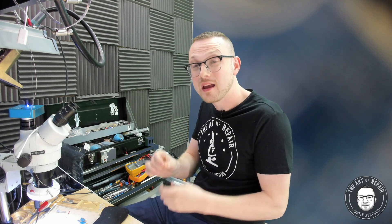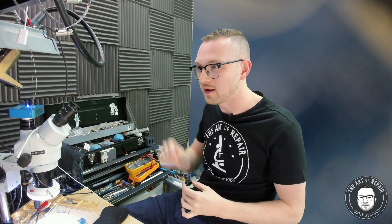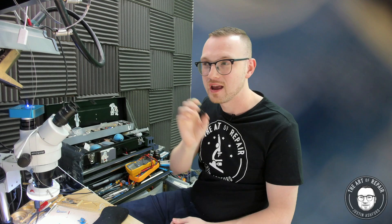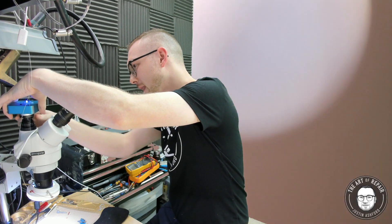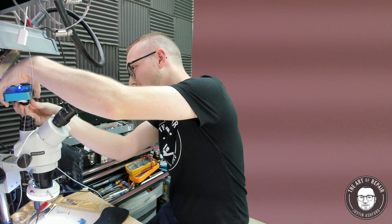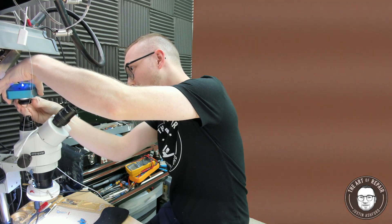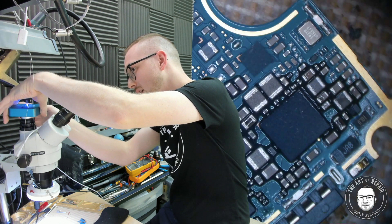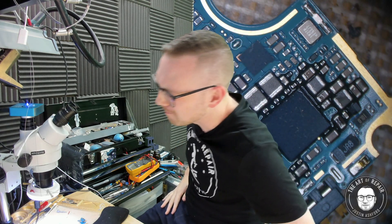C and CS mounts actually have different focal points, meaning the point at which light converges onto the sensor is a little different between each one. Right now we've got a super blurry image. We're gonna take this simple, super cheap 5mm adapter and carefully put it on here — and you saw how I got sharp there for a second. That's your clue right there: the focal point was wrong. We're carefully going to stick this 5mm adapter on and then put the original mounting bracket back on.